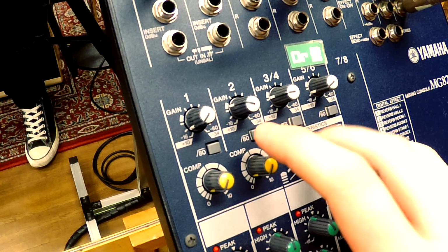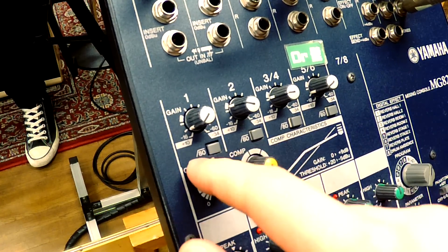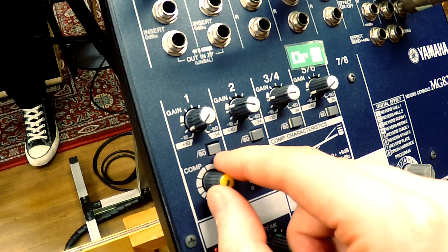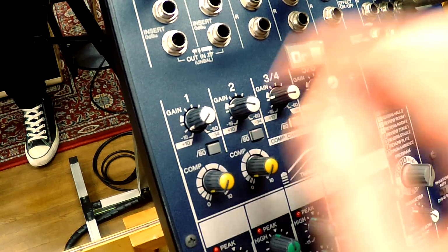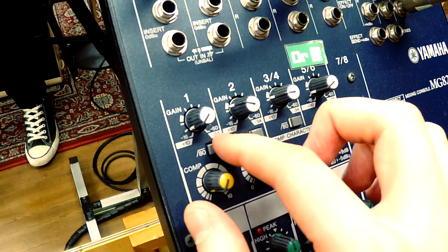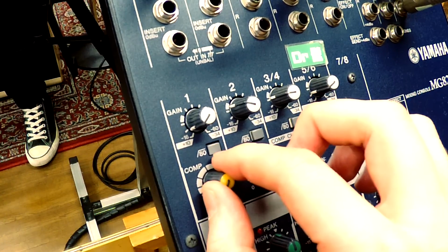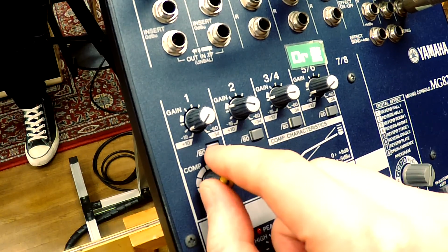Okay, one last thing to cover before we move on to my ideal microphone setup. I forgot to mention, can you see this 80 here? Well, this little symbol, an 80, means that the frequency under 80 Hertz is rolled off. We call this an 80 Hertz roll off. So the really low, whoa, whoa kind of sounds that are under that 80 Hertz get taken out of this signal. When we're working with a microphone that's really not ideal for the purpose, the back of the cajon with that sound hole there is pushing out a lot of kind of unbalanced, disproportionately low noise, right? So then we can press that and we'll get a nicer signal.